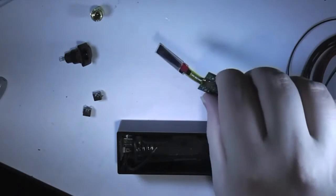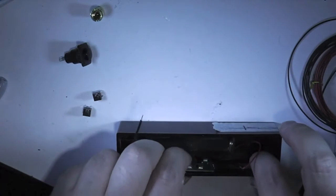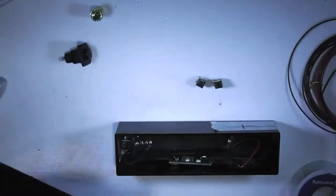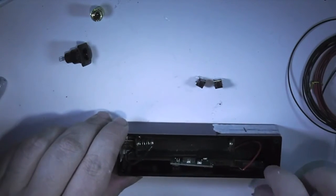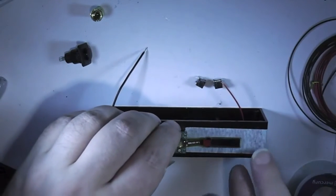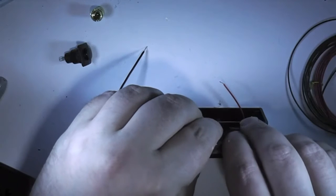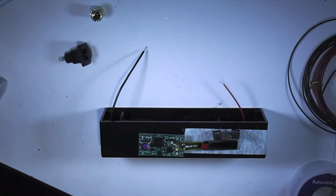And the DNA 20 itself is going to sit this way on, in between the edge of the case and the battery holder, with the up and down control buttons, which are these two micro switches, sitting above the display along this edge. So when it's done, I'll have a hole cut out so that the display shows through, and two little switches above it to move it up and down. And that's basically going to be it.